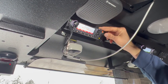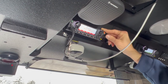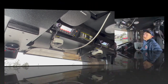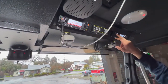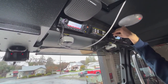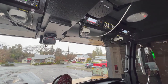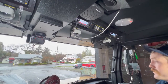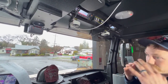Up here in the right-hand corner is an orange emergency button. If you need to alert everyone on the fire ground, you hold that down and it will send out an emergency signal and hot-mic the radio so you can talk on it. Our power buttons are located on the left side of the volume control knob for each radio. Note that you cannot actually turn off the radio physically with this button — it's a safety feature to prevent accidental shutdown. Also remember: both radios cannot be on the same channel or you will get major squelching feedback, similar to keying two portable radios together.